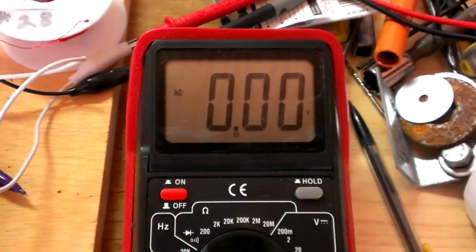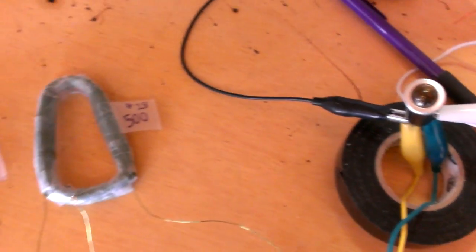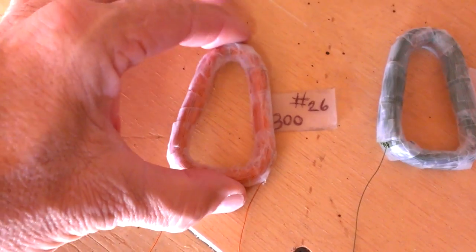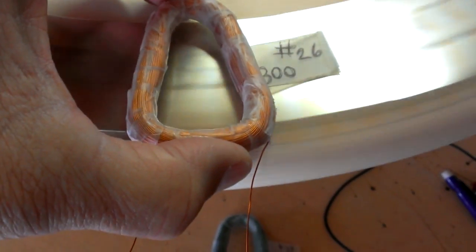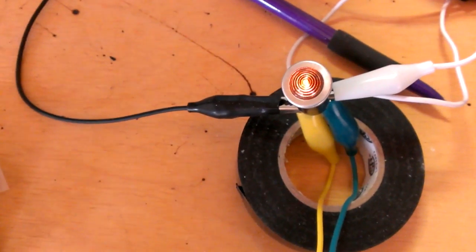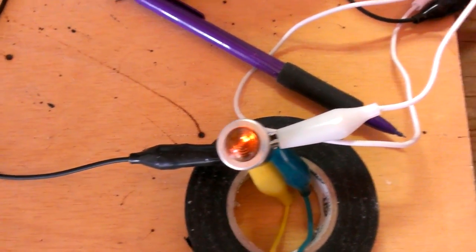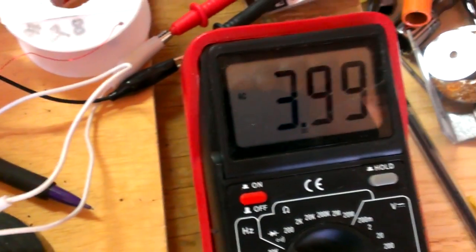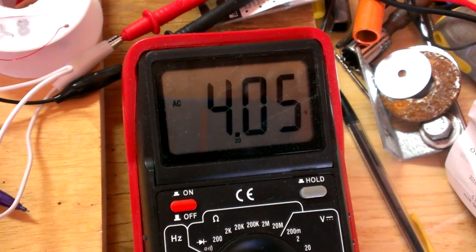To show you what's going on, here's my digital meter, and here's a light bulb. I'm going to first grab this coil that's been wrapped 300 times, and we're going to check it out. Here we have some indication on the light bulb that we have power. Now we're here on the meter — about 4 volts.